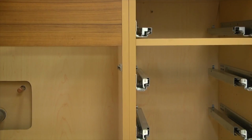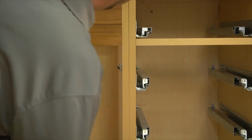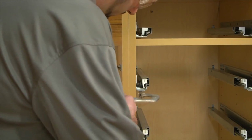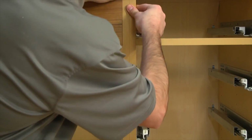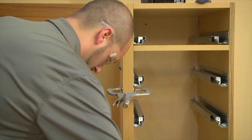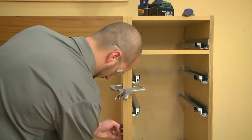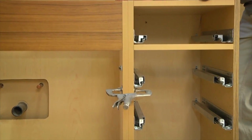When installing cabinets, the goal is to achieve level and plumb. This will ensure level countertops. It'll make sure water or other liquids will not run off to a low spot or to the floor. Plus, final alignment, all the doors and drawers will be a minimal process. Rather than installing one cabinet at a time, a preferred method is to connect a series of 2 to 4 cabinets as a unit. Then level and connect this unit of cabinet boxes to the wall studs.